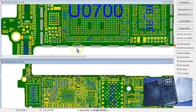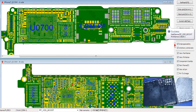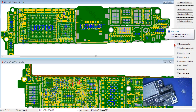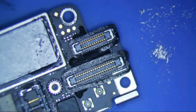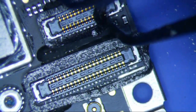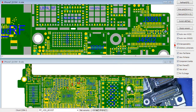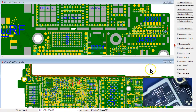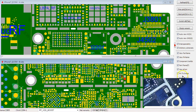So the question now is how do we find where the short is on this phone? The board looks very, very clean. There's only really one component on the top side of the board and it looks fine. It's possible that's the problem but most likely not. It looks like most of the caps are centered around the back side of the board near the PMIC, and there are a few things near the backlight system.